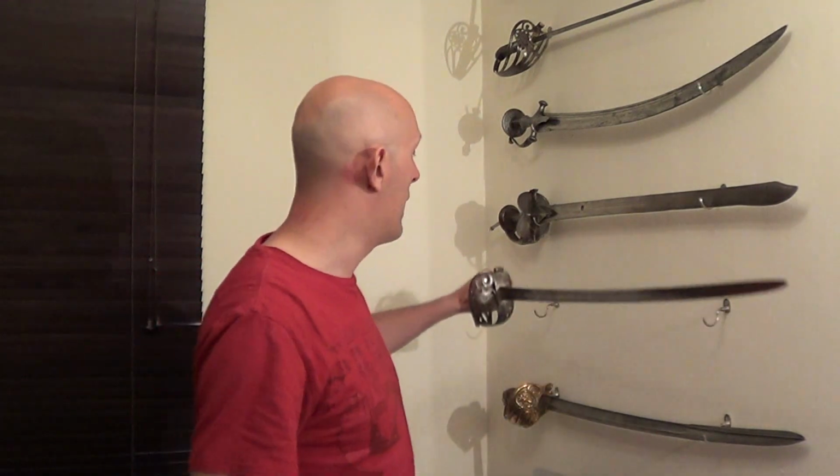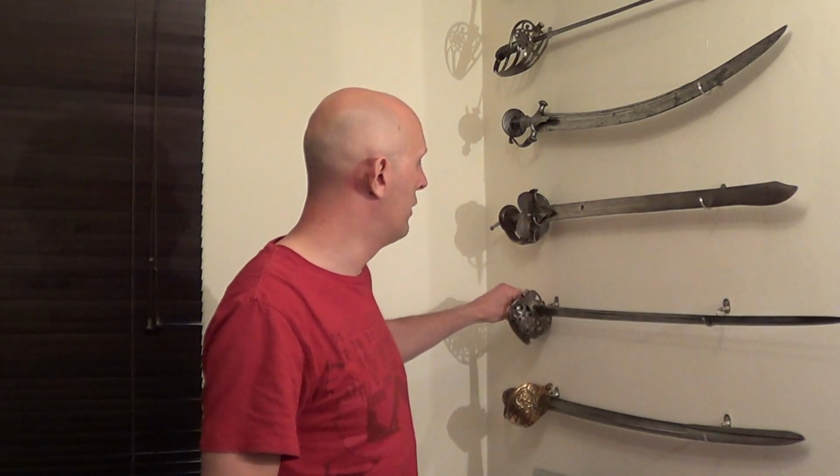And I should mention the katana, because a lot of people talk about katanas as soon as I mention cutting at all. The point to make is that it's generally quite a thick blade, and the antique ones very often don't have very much distal taper. They usually do have some, but not very much. So at the cutting portion of the blade, they're usually quite thick, thicker than most blades from other parts of the world: sabers, tulwars, shamshirs, kilij, other types of sword. So in actual fact, the katana is quite a thick blade.